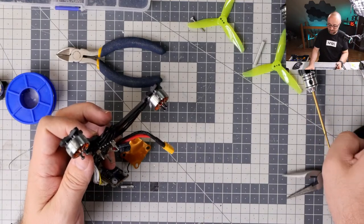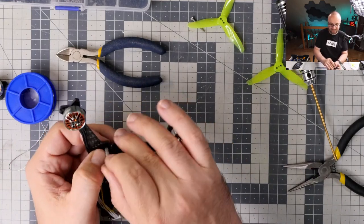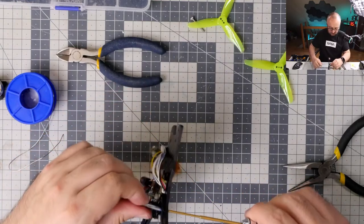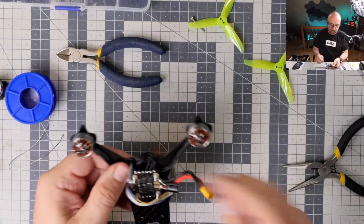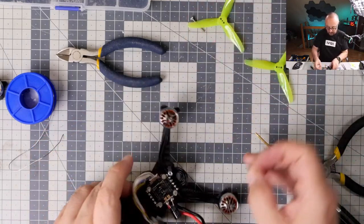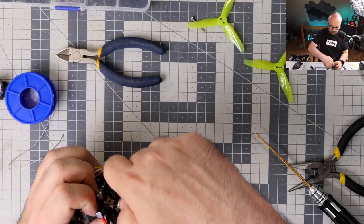Let's put front standoffs to give some shape to this contraption. And yeah, it will be fine. One viewer asks, how about braiding the wires? This is not the best idea to braid the wires, especially when you make the wires longer, because when you braid the wires you increase the chance that the back EMF on the phase detection will be wrongly propagated between the phases. So not the best idea ever. You should try whatever you can to have as little interaction as possible between the wires, and unfortunately braiding them is not really doing that.